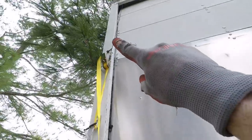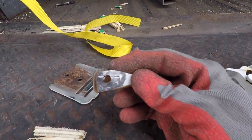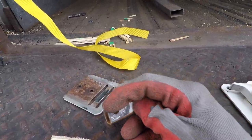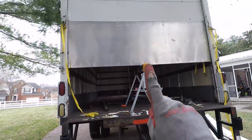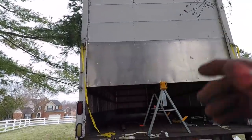These little brackets are the spring tension brackets that mount on the bottom. When I was removing one yesterday I went a little overboard with the grinder and dug into it, so I used the wire wheel to clean it up. I'm going to run a weld bead there and smooth it down to make it stronger, then get these mounted on the bottom. I'll probably use a high lift jack in the center to get it jacked up high enough to attach them, and then we'll see if it works.